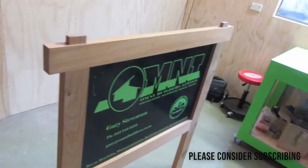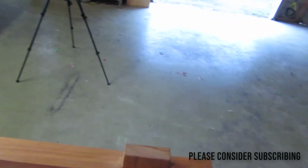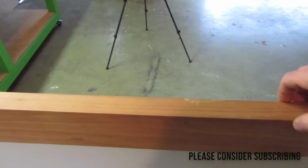So going around the sign, as you can see, we've got a couple of mortise and tenon joints. We've got wedges on the side. This is so that these wedges can be wiggled out, so that this top piece can be removed, so that the actual sign that's inside here, because it's been grooved out, can be lifted out, which I'll show you in a minute. Down in the bottom here, we also have some housed mortise and tenons.